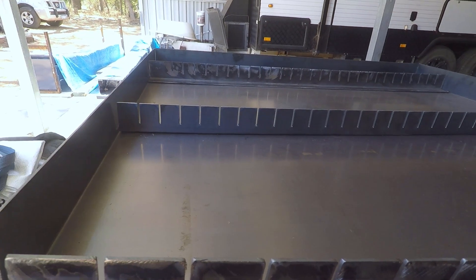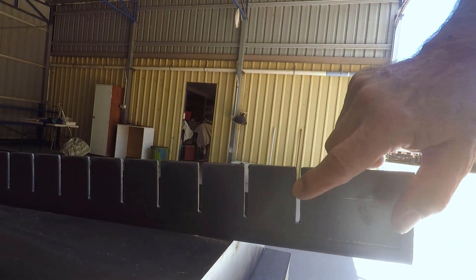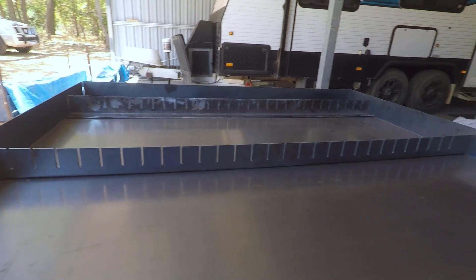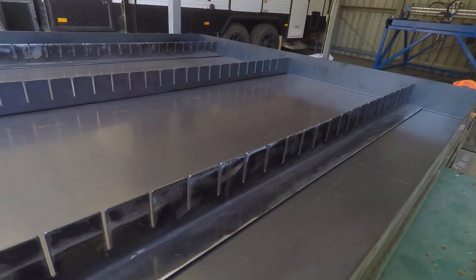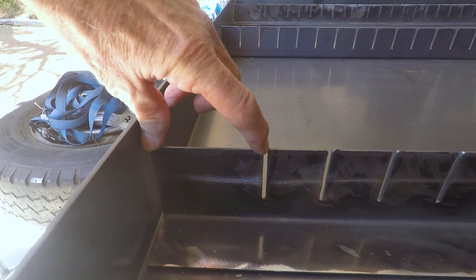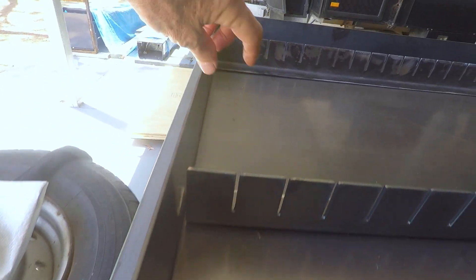The slots are too deep. What I'm going to do is put a plate across to give me a 25 mil deep slot, and then the slat will fit above this by 25, which should give me a level finish. I've got three of these — just need to be flattened, they're a little bit wobbly. You can see the gap between the front of the plate and this one varies across the three frames.